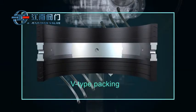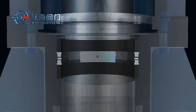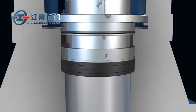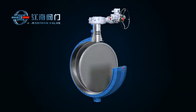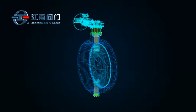The stem axial seal stuffing box has a double V packing structure. One set of packing is loaded and the other set is backward loaded with a spacer ring placed in between. This structure can effectively shut off contact between the atmosphere and the medium within the pipe when pressure fluctuates, ensuring complete vacuum without having to use water or air as a secondary seal.